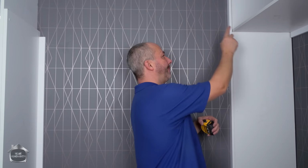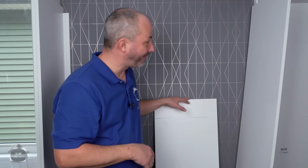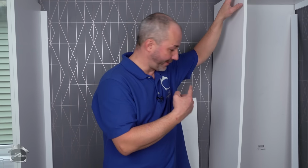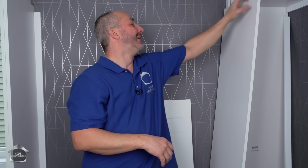All right, so I'm gonna go cut a shelf that's 49 and a hair, and I'm gonna cut out this back corner to sit around this edge here. Come up tight to here, use the mending plates, throw a couple of nails in. Again, we're gonna put a crossbar in here to carry some weight. We're gonna throw in this panel here. We're almost done. All right, so I've got my shelf, I've got my support board, and I've got my little 1x2 because we're gonna have to nail the back again to keep it straight.